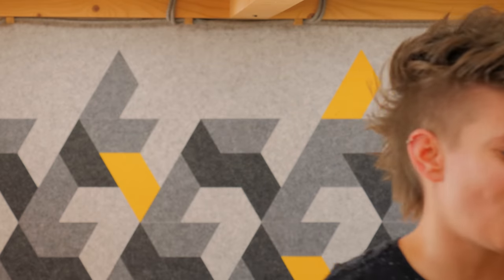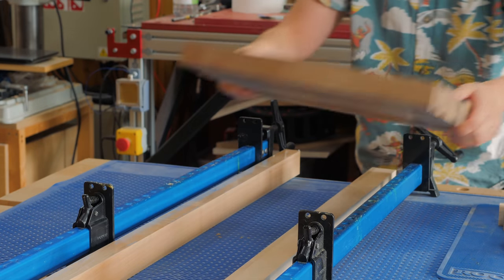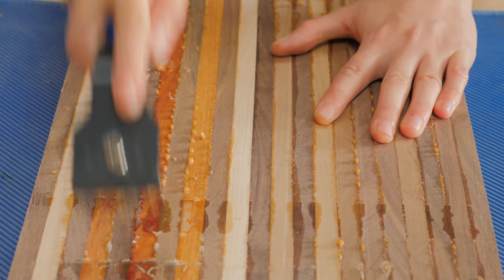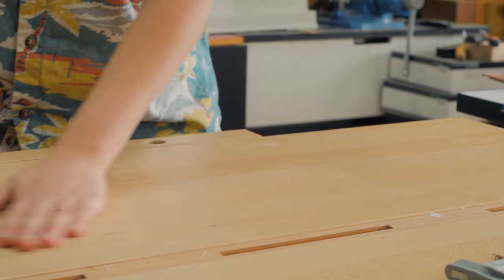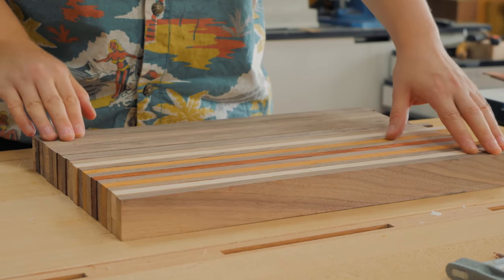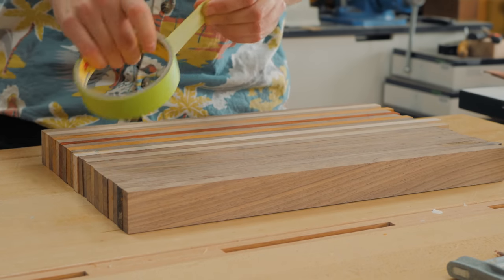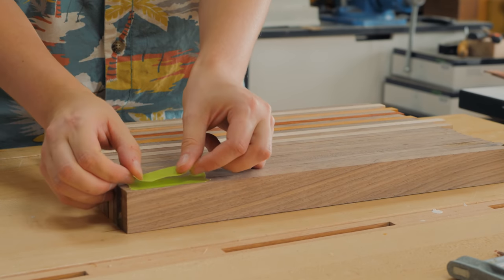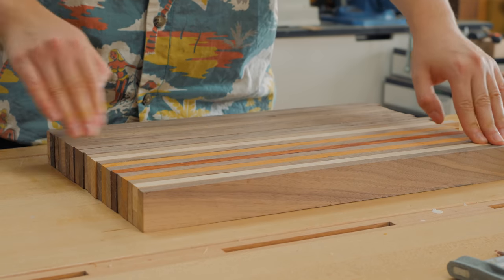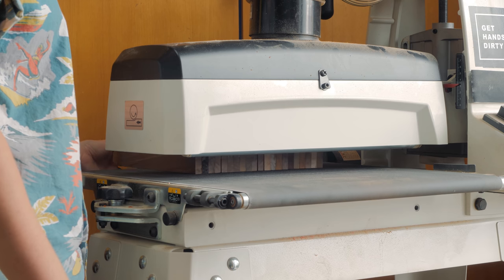Okay, let's see if the glue is already dry. After scraping the glue, I could see if there was any warping in the boards. I could feel that two corners were a little higher than the other two, so I applied a bit of masking tape to one of the corners to create a flat reference face for the drum sander. Once the top face was sanded flat, I could reverse it and make the second face parallel to the first one.